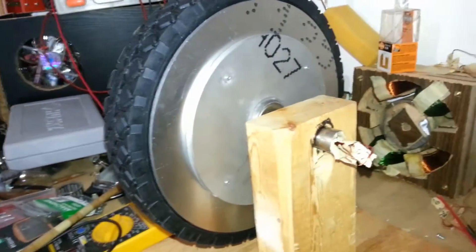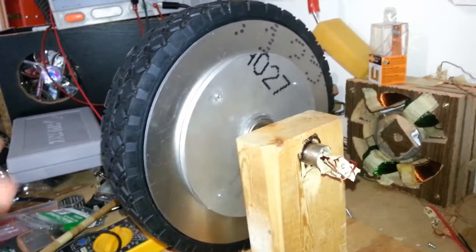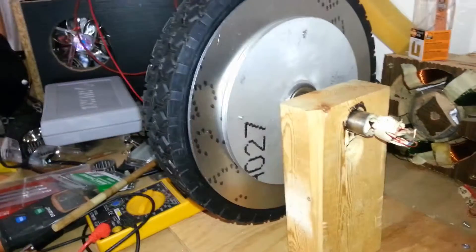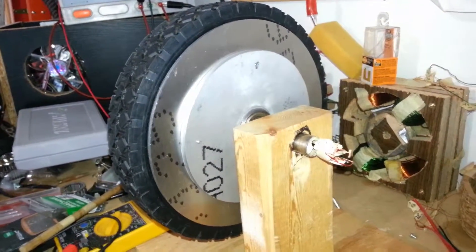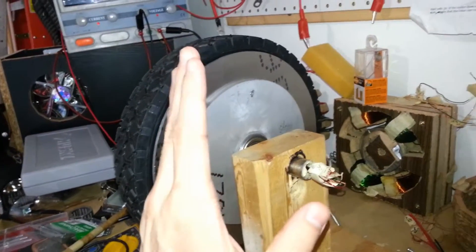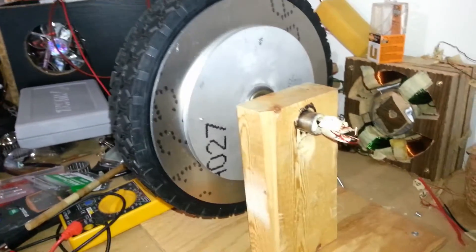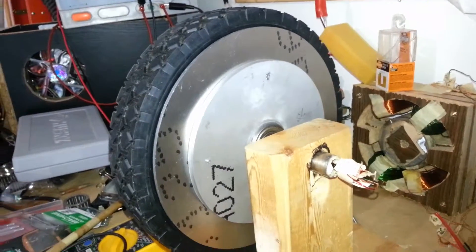There are a few types of motors that actually do benefit from cogging torque — one is called a stepper motor. Every time it's activated, it'll turn one position, little by little. That's actually by design — you might want it to snap into an exact position. A clock is a great example. Some clocks go continuously, but others on the second or minute hand step to each position around the clock.